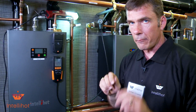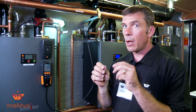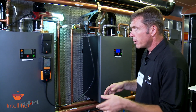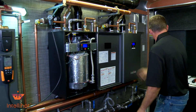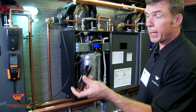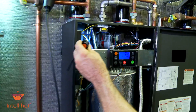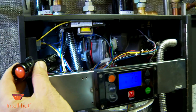If you do make adjustments, you need to make small increments — not long turns. Maybe quarter turns starting off on your high fire, and just barely turning on your low fire. Okay, here goes the noise. This looks like it could be a pain to get to, but they're all the way back there. They're really not a pain if you have long screwdrivers and a long Allen wrench.